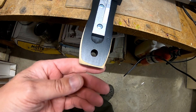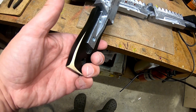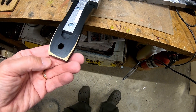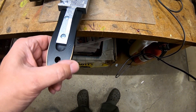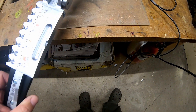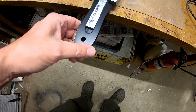Do-It handles are pretty sharp — they have some sharp edges. I just took a simple file to break the edge. Not all of the handles — I do this on these two, which were my newest molds bought in 2023. I just took a file and broke this corner particularly because it would dig into the palm of my hand. After a few hundred jigs I started feeling this edge on my fingertips on my left hand, so this edge also got broken.